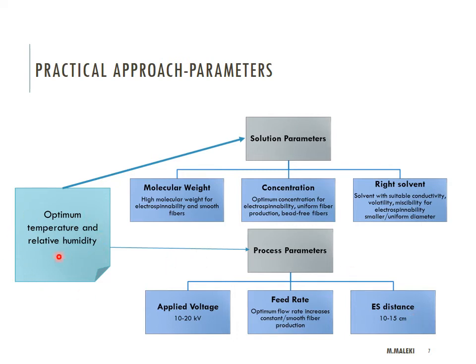Some polymers are very sensitive to temperature and especially to relative humidity. Many labs use homemade or simple electrospinning setups without a controlled environment. I would suggest that you always write down the relative humidity at which you collect nice fibers, because for some polymers it is very important — sometimes in summer you can collect fibers but in winter you cannot. So always record the temperature and relative humidity in the lab when you do electrospinning.